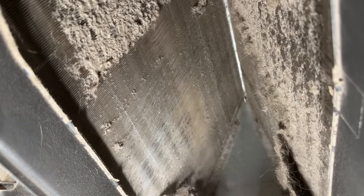Rinsing with a water bottle isn't necessary if you don't have one — the condensation water will rinse the coil off — but I'm just going to take a bottle of water and rinse this off. You can see the dirt coming off. That is amazing — that side is beautiful now. In contrast, let's go ahead and look at the other side which we haven't sprayed down yet. There's the side we haven't sprayed and there's the side we have sprayed — quite a difference. So we're going to go ahead and do the same thing on this side, working from the bottom up.